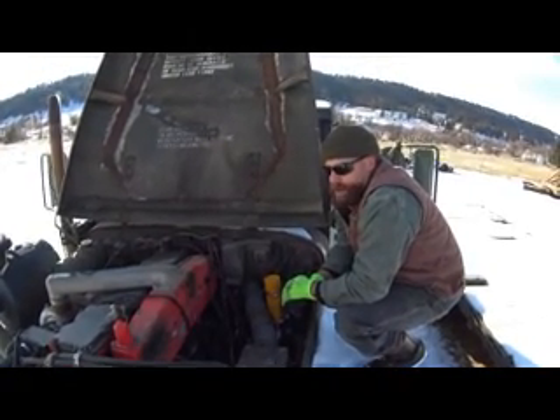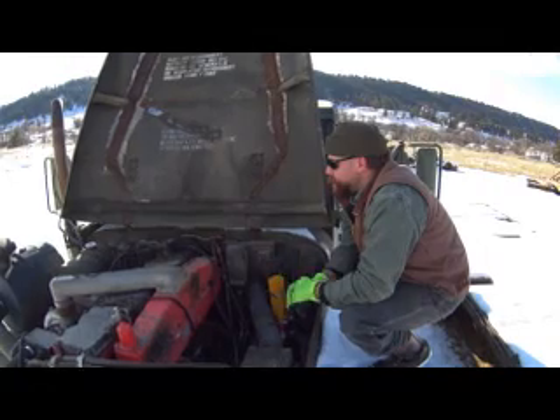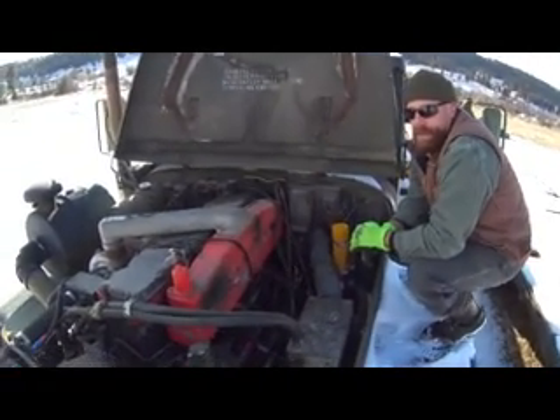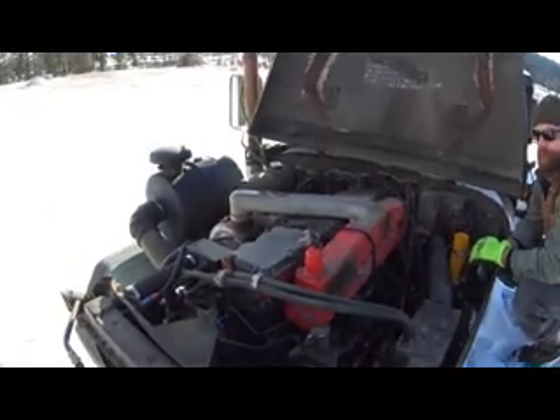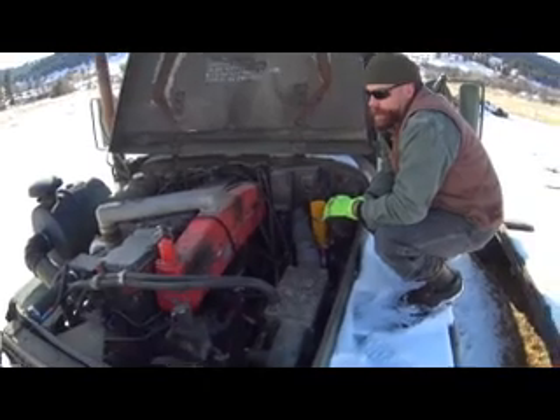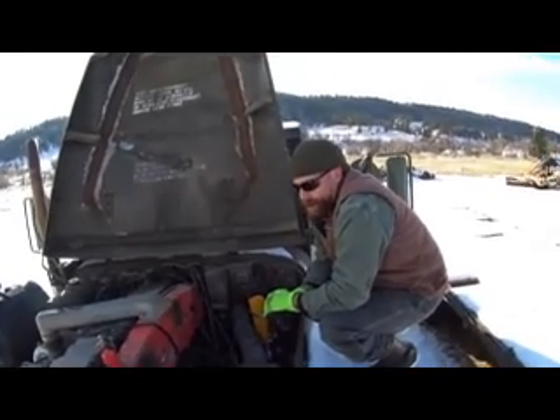Jakes — that's imperative. If you're going to have one of these old trucks, this 816 wrecker weighs in at 36,000 pounds. The jake brake on that five-speed — you need it. It really does a good job of slowing this thing down; otherwise the air-over-hydraulic brakes are vastly inadequate.